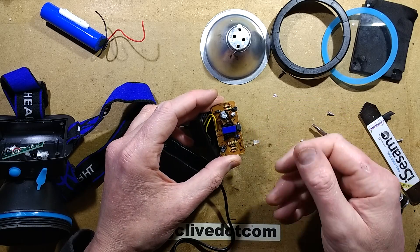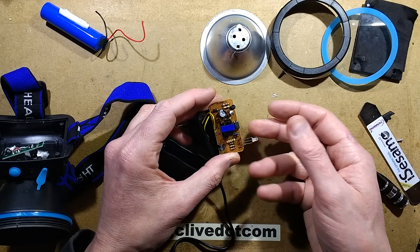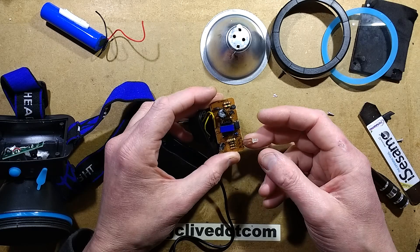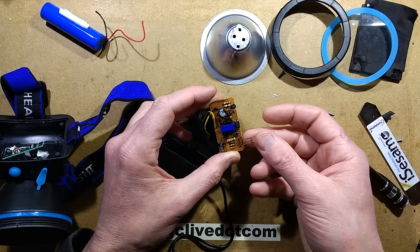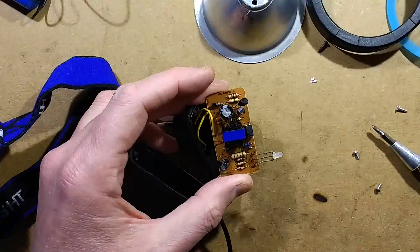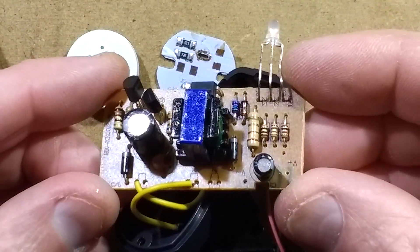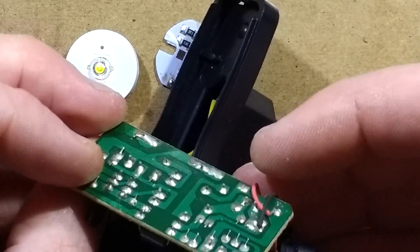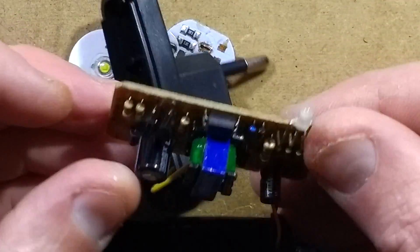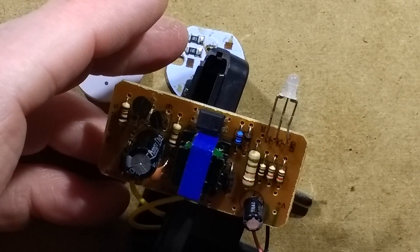Looking at this in detail: it's got the single diode for the rectifier, a main smoothing capacitor, and then essentially the resistors here are just keeping the green LED lit all the time. But when it reaches a certain voltage threshold, it's not actually tied into what the feedback is sensing. In previous ones I've looked at, the red LED went out and the green became visible anywhere between 3.7 volts upwards — it didn't give an accurate end-of-charge indication.